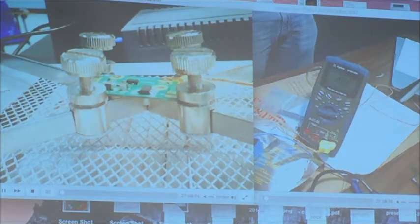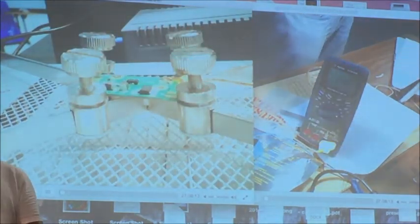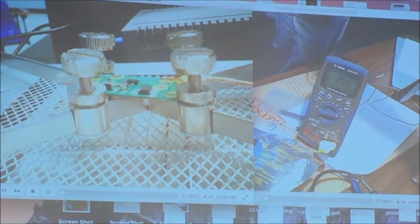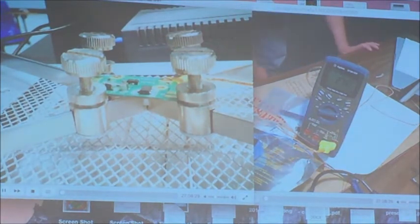There's a hot plate here, right? Now this infrared preheater. Does it have a fan blowing hot air? No. You have a ceramic heater underneath, and it just uses infrared radiation. There are preheaters which use hot air, but...